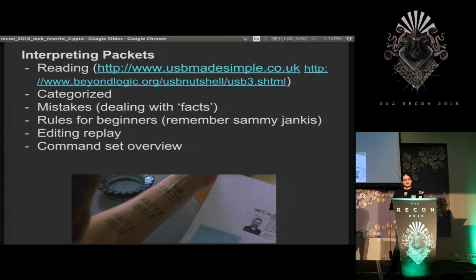It took a lot of reading of the libUSB specification to understand the packets. So if anyone's interested in learning some more about USB, these are the resources that were most helpful for me. Once I had all the packets captured in Wireshark, I took them out by their command IDs and made a big table of them, said how many times they appeared, listed them off, and wrote descriptions of how I saw them used and theories about it.